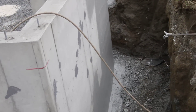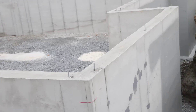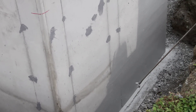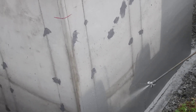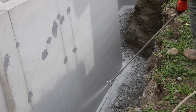Dennis is spraying approximately 1,100 square feet here this morning and it'll take about half an hour to 40 minutes to get this project done. We offer the Deco20 Clear Seal, which is a damp-proof product below grade and a waterproof product above grade. But if you want complete waterproof protection both below grade and above grade, you would go with the Deco20 membrane product.